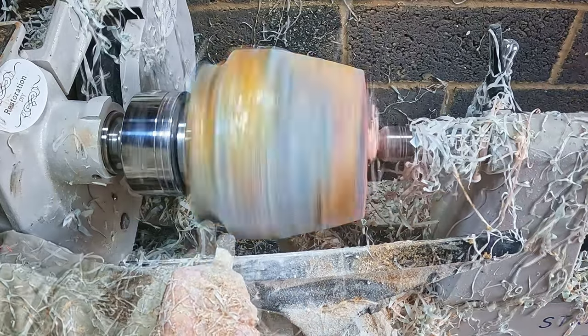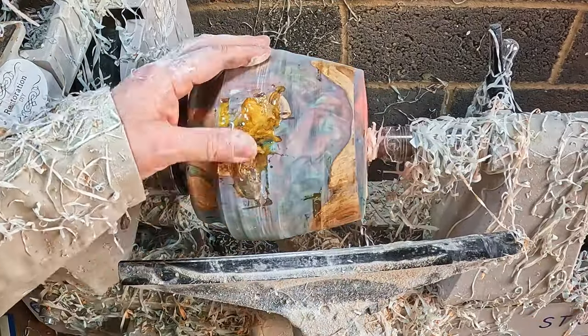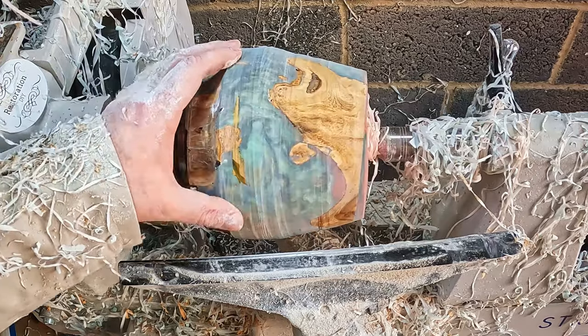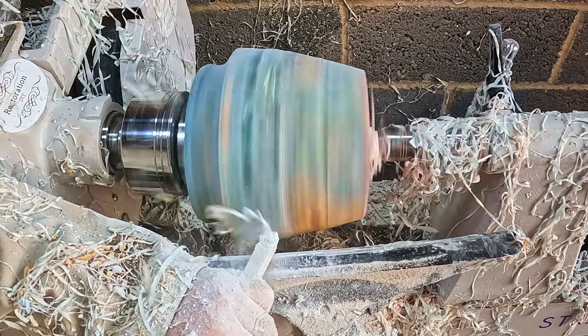After the repairs had cured, I used a full-size carbide to gently remove the excess and get the surface nice and level - but doing this just opened up more voids. This was not going well. Having had time to think about it, I think what happened was the voids were formed by bubbles of air coming out of the porous yew, trapped by the rapidly curing epoxy.